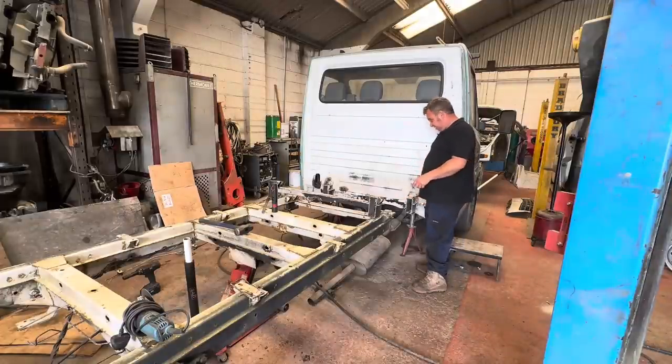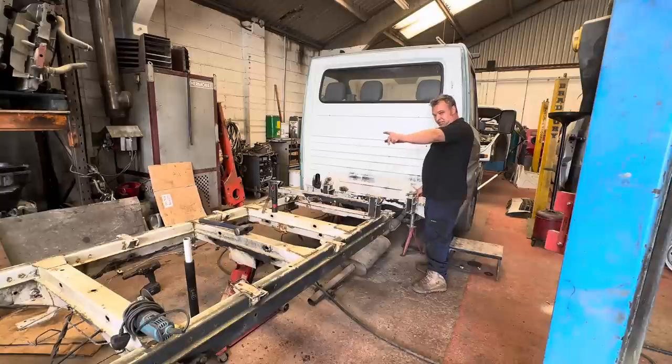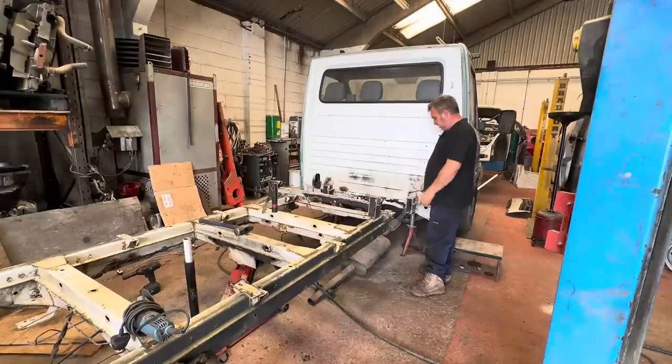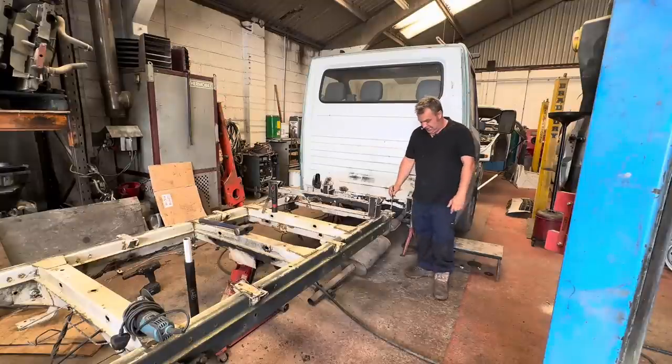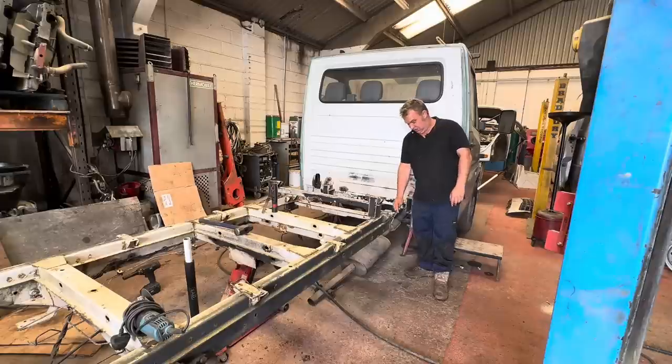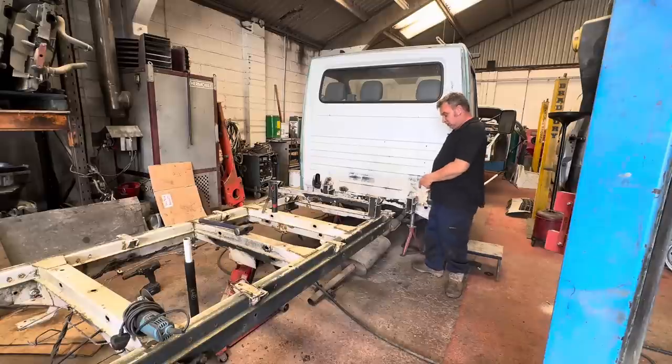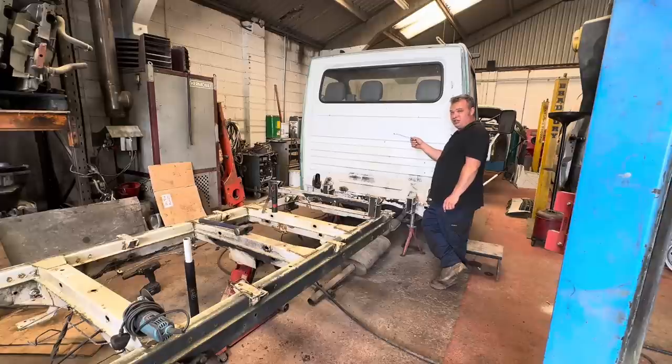And then obviously it's 13 foot dead on from here to the back of this chassis once it's here. Then we've got to make sure it's level and true. So it's going to involve a lot of measuring. Then it's a heavy butt weld round these, with extra weld on all four sides, rejoin the chassis, grind it up, and then it should be super strong so we can put that little crane cradle on the back here. Got rid of the rusty, minging, horrible chassis, and we've got a really good one now.